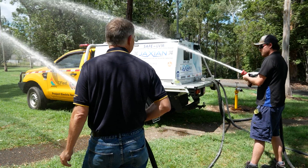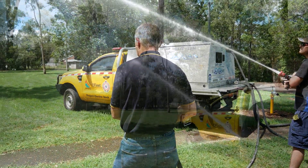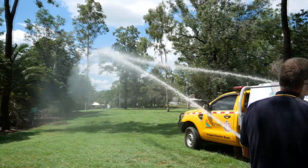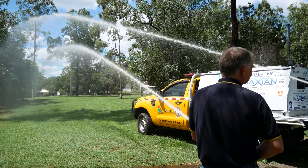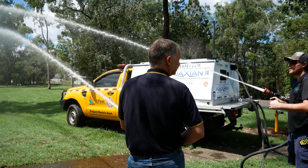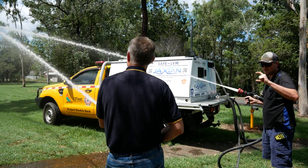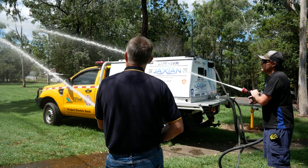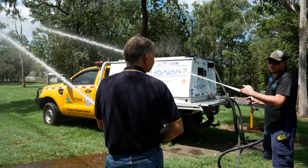And then your pressure just comes straight back up. When it gets to 20% we'll lose the high pressure and go to a lower pressure. When it gets down to 10% it will cut out, which leaves you 10% for deluge. Those numbers are all adjustable — whatever you want them to be. You'll always cut out at 10%, and that can only be turned on by deluge.